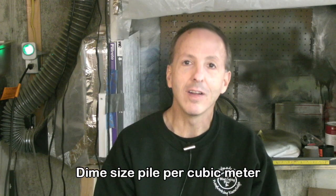Let me put this in perspective for you. OSHA has a requirement that in the workplace, you should only be exposed to 15 milligrams per cubic meter of fine dust. I wonder how much that is. That's about a dime-sized pile of fine dust in an 8-hour period. And that's not a lot of dust.